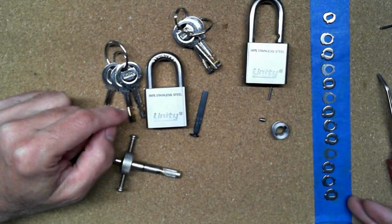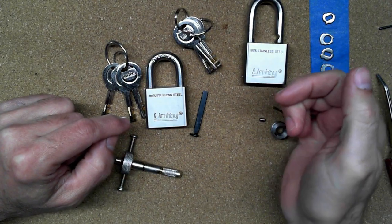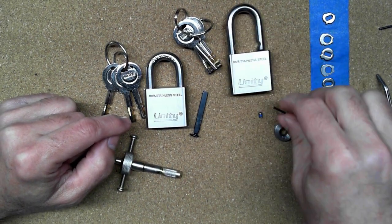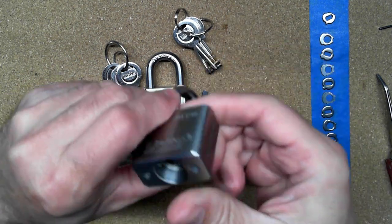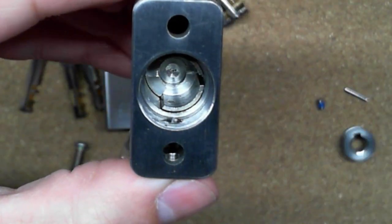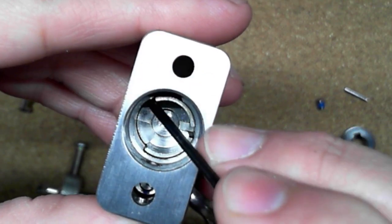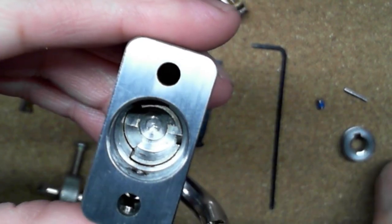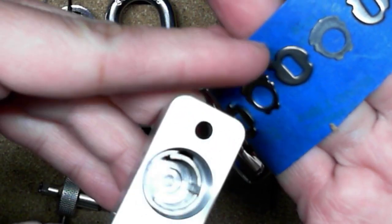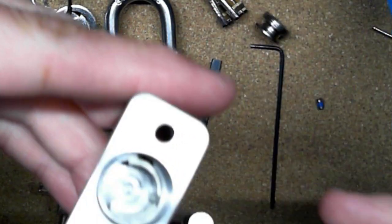I gutted the twin, so these are all the discs — seven discs with spacers — and here's the sidebar right there. We've got the screw cap and the grub screw. Take that grub screw out and we can see inside. You can see the sleeve and the side where the sidebar slides in. This side is where the back tab of the disc goes, which limits the travel. On the disc you have the notch at the top where the sidebar fits in.